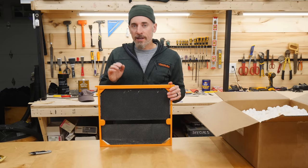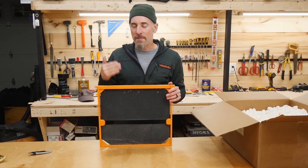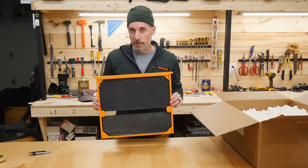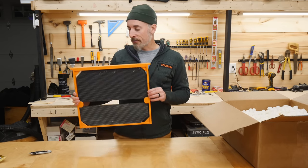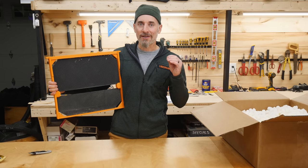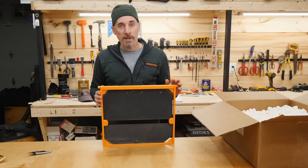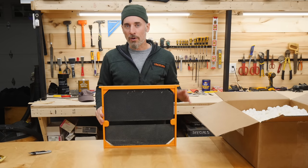I want to get a lot of these made because there's a lot of people out there asking for them, asking for bee barns and wanting to know how to build bee barns. 3D printing is not the way to go — to make this on a 3D printer, it had to go on their special printer, like a $2 million machine that looks like a huge refrigerator, and it took all night to print. With the design cost plus the printing cost, this frame cost about $700. Not very cost efficient for the masses. My idea is to get these frames injection molded and mass produced. To do that, you have to make a mold, and once you make a mold you send it to an injection company — then they can injection mold plastic frames in tons and tons for very cheap and a lot more efficiently. The final goal is injection molding frames.